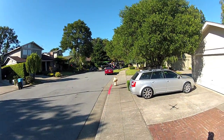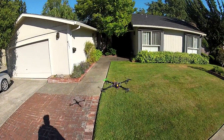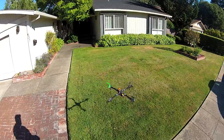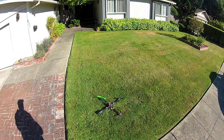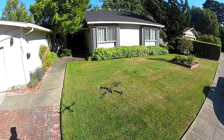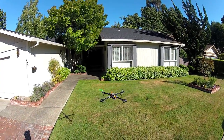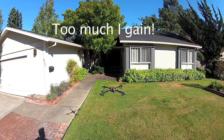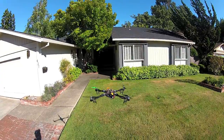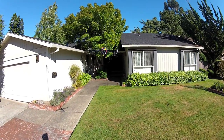You can see it bouncing around — it also becomes very difficult to maintain altitude, it tends to jump up and down. It's just a nightmare to fly, and that's when you know the P gain is too high; that was at about 120. This is my I gain oscillation — totally different, much slower, and that was at about 100. This quad ended up flying at around 40 to 45 P gain and 60 I gain.